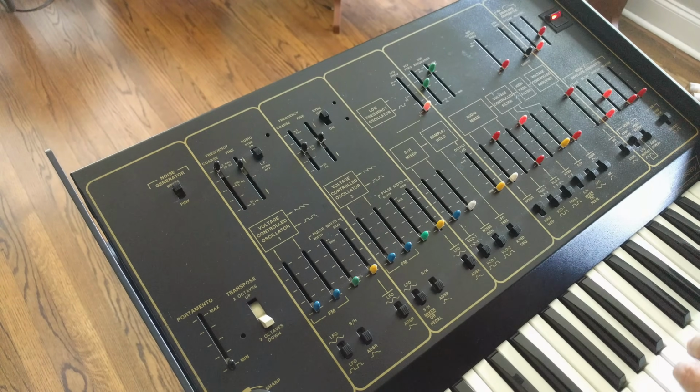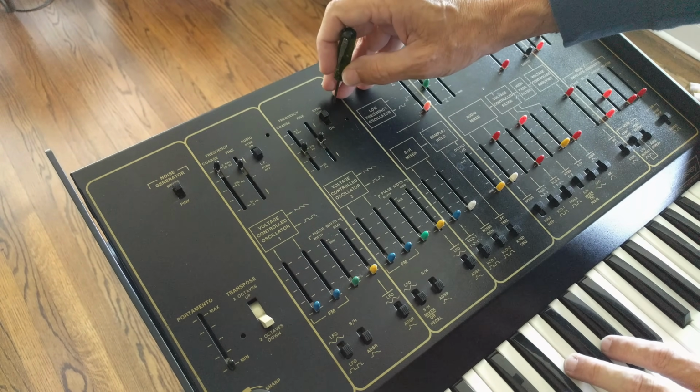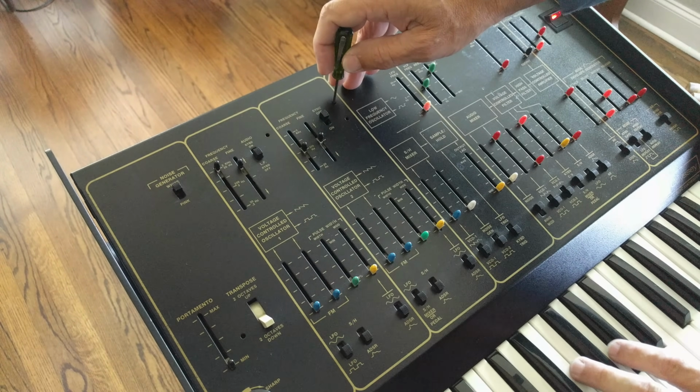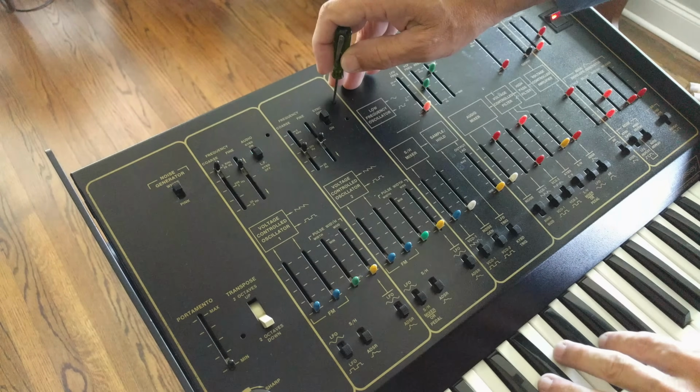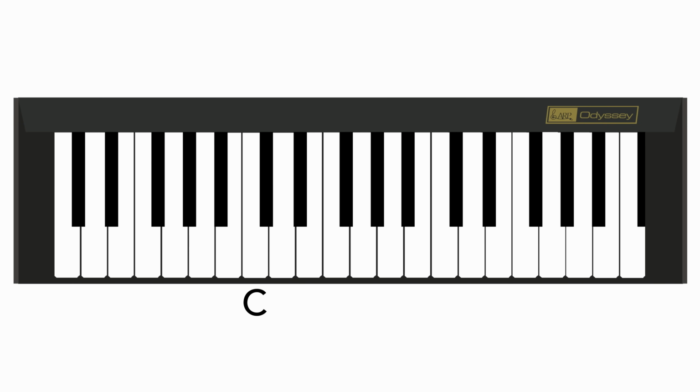The tricky part is that these two adjustments, tune and scale, work together to drive you bonkers. Whenever you adjust one, it affects the other. So after you adjust the scale, you might find that now the basic tuning is off again, and you've got to get middle C back to playing middle C. And after you do that, your octave scaling isn't right anymore.